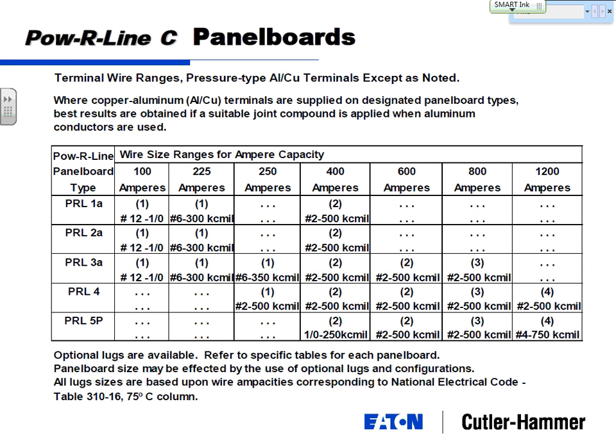So you're not aware of any switchgear that is rated for 90 degree cables in low voltage? Correct. Now, I'll throw an asterisk, you may find some OEMs, somebody who does specific industry switchgear or switchboards. You know, maybe that's their niche, they've designed a product that can do this, but from the major manufacturers, it doesn't exist.